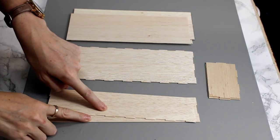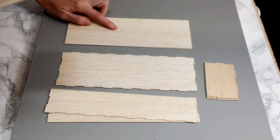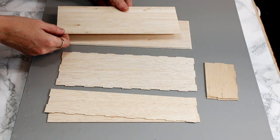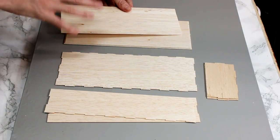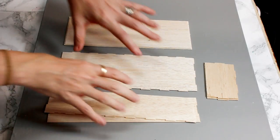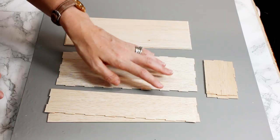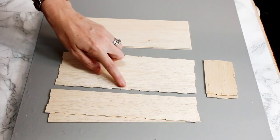I've got my two long sides, two shorter sides, my bottom piece, my larger top piece, and my smaller top piece which sits on top to create a lip so it sits nicely on the jewelry box. I've also cut another smaller piece exactly the same to add on top of the lid as a little accent. I suggest adding some glue because the sides are quite short and will need reinforcing — I recommend just using a small bit of Gorilla Glue along each of the joins.